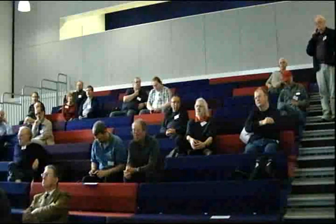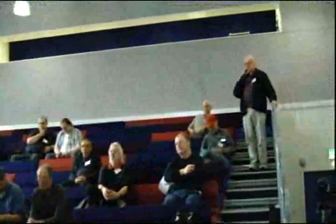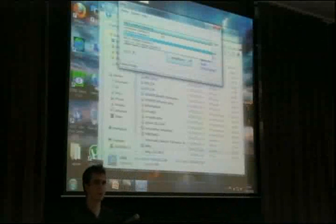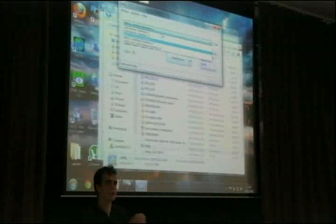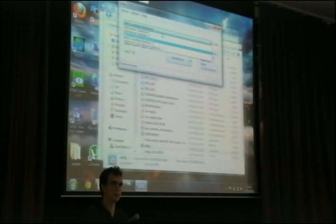And a question, Philip: obviously it was meant for DVB-T. Are there any QPSK demodulators about, or anybody working on that? Well, the DVB-T is built into the Realtek chipset, and actually it's completely separate from what we're using here. So we don't actually use any of the DVB stuff at all on that side of the chip. We just use that ADC that's designed for the FM and DAB.